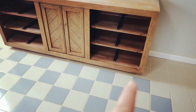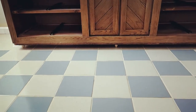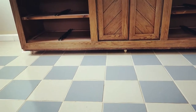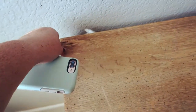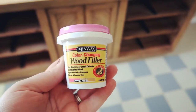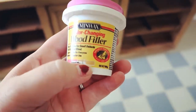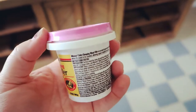The legs are on and we've put it back where it goes — you can see it's just raised up a little bit. I just didn't want it completely sitting on the ground, so those little legs on the bottom will be totally fine. The next step is filling in all the spots where they tried to sand and didn't do a great job, so the veneer is just kind of coming off. I'll patch those areas with wood filler and then sand it down to get it ready for paint. The wood filler I'm using is the Minwax color-changing wood filler — it goes on pink and then turns a light brown color when it's dry. I'm just going to use a little spackle knife to put that on so it goes on nice and smooth.